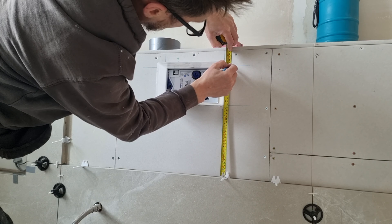I use this method on most square cuts. With a plug socket, I'd normally cut straight from the back of the tile, as with a 4-inch blade you won't cut much out of the front. And there she is fixed. A quick little tutorial there guys on how I cut squares out of tiles — I hope it helps. Catch you in the next one.